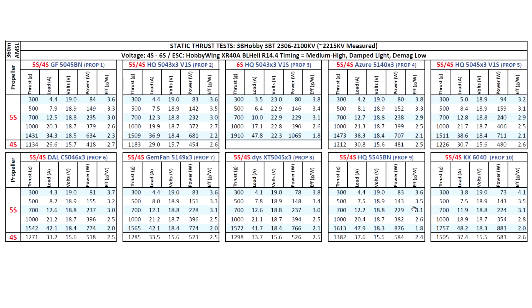Of course, if you keep the motor at 100% throttle it'll overheat and most likely fry the windings - but that's static thrust, where the motor sees the highest load. When you're flying, amps are much lower and you get cooling airflow. We only do short full-throttle runs and we're always moving the throttle back and forth, not continuous 100%. That's why we can run these motors at such high loads and they survive. But if you keep a motor at 100% continuously, it will eventually saturate with heat and things will start to melt.